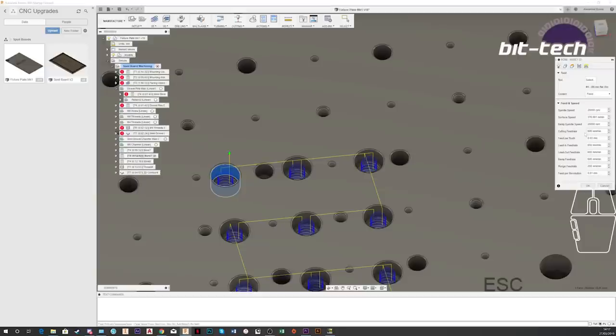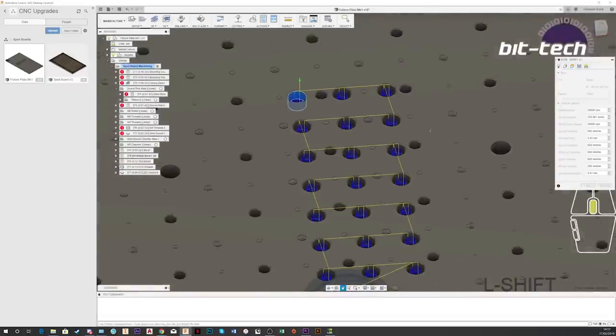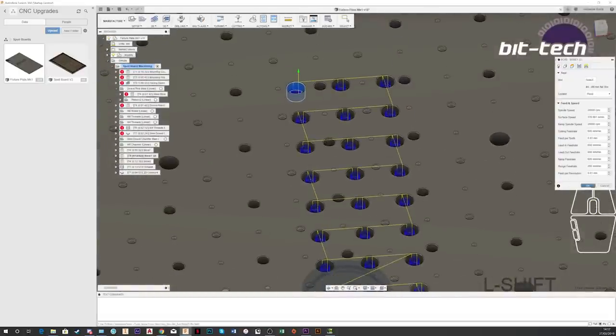I'm going to be using a standard 600mm per minute. So I'm sort of aiming for a 0.03mm feed per tooth and 376, 380. Basically, I want to hang around the kind of 380 surface meter per minute mark. That tends to work very well with the end mills and machine that I've got. And I'm basically just going to use those same settings for all the various tools.